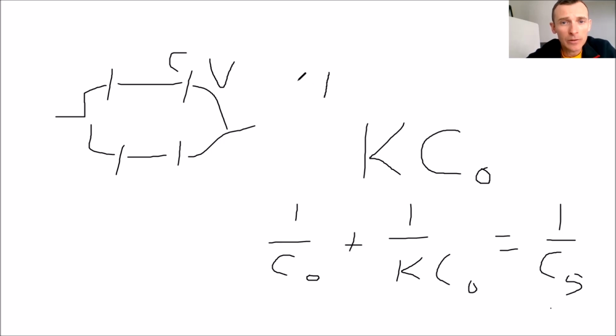So I can leave that up there. They're telling us how Q will change. So they find Q and then put in that factor to get a new Q. Your voltage is going to be different. This capacitance is going to get bigger, which means it's going to require less voltage. So V is going to get a little smaller. Don't just use the V you used in the first part for the second part. Find Q, multiply by the new factor, and then, like I said, you have voltage being shared across the two.